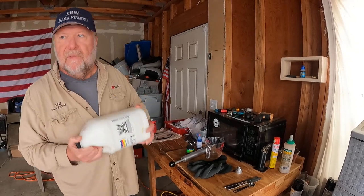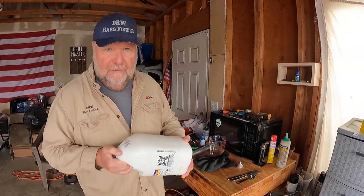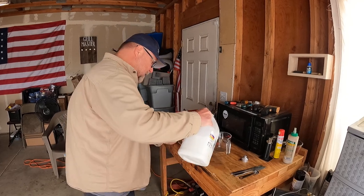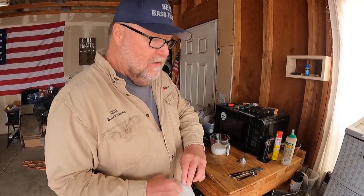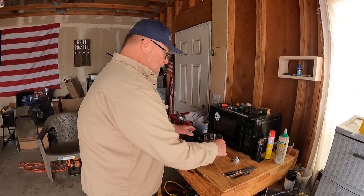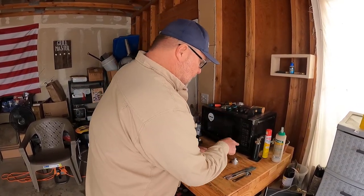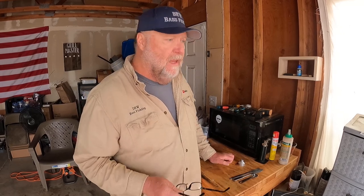The first thing you're going to want to do — and I guarantee you this is real important — you are going to want to shake this thing about 50 to 60 times because you want your plastic to be ready. I got it all shook up. Now I'm going to pour one cup of plastic. I like to go one cup at a time. On this microwave, which was a whopping $40 at Walmart, I'm going to set it for four minutes initially. The goal is to get this plastic to 350 to 360 degrees. If you don't maintain that temperature, it's not going to come out right. I'll get the molds out and we'll talk about those.